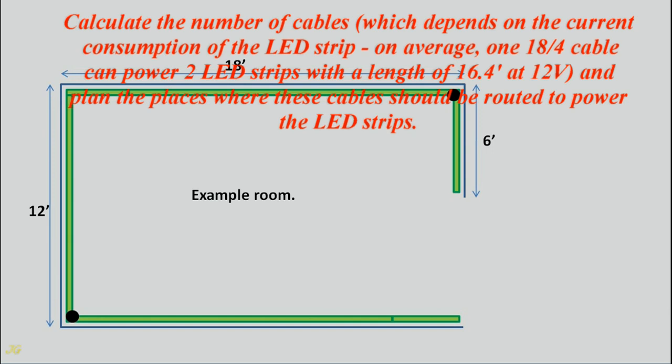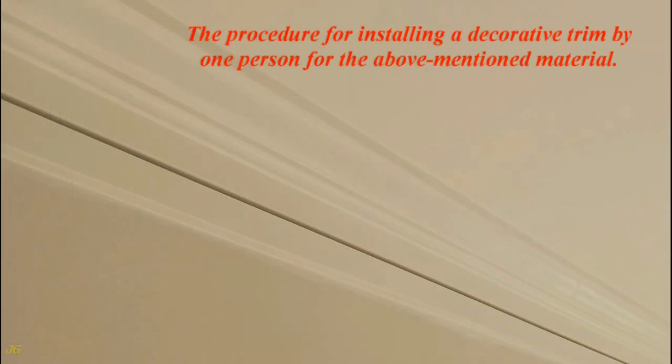Calculate the number of cables, which depends on the current consumption of the LED strip. On average, one 18/4 cable can power 2 LED strips with a length of 16.4 feet at 12 volts, and plan the places where these cables should be routed to power the LED strips. The procedure for installing a decorative trim by one person for the above-mentioned material: